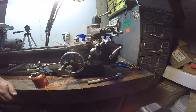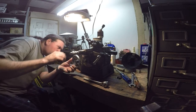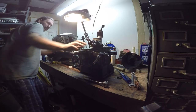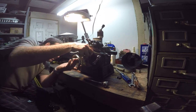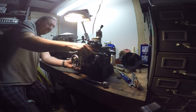Raise the lever and move the carriage to the center of the bed. We've got to be careful here — we've got to engage the gears into the rack that's on the bed. There we go. You have to slide it out far enough that you're off the rack first.